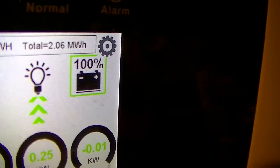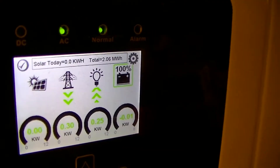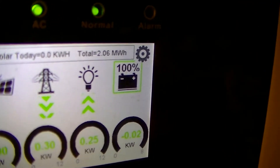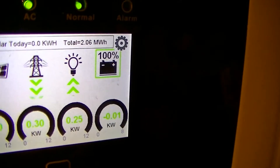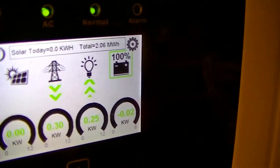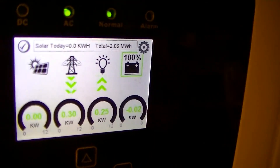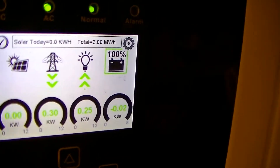Having a state-of-charge monitoring algorithm which monitors power flow into and out of the battery, especially into, is important — because it looks like this algorithm is fairly dependent on operating potential of the battery to which it's connected. That works for things like lithium-ion and lithium iron phosphate, much less so for lead-acid.